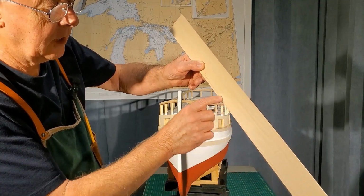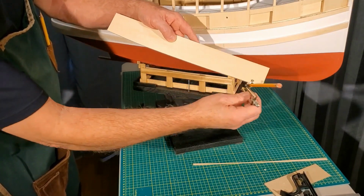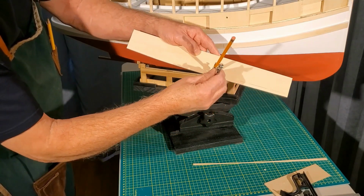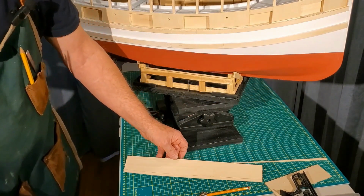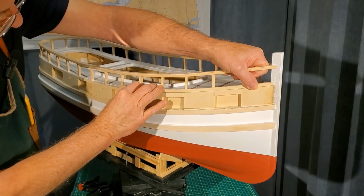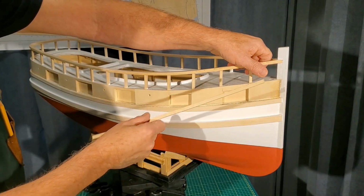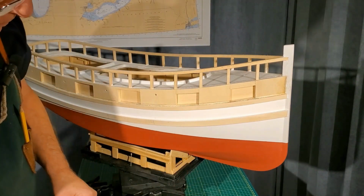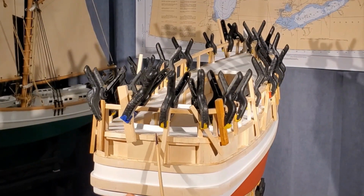And then I'll cut out this line. And now using my marker tool, which is set to just over 1/4 of an inch, I'll make a line along that curve. And now cut that out. And here's our piece. And that's a pretty good fit. So I'll go ahead now and cut all the pieces I need for this strip and clamp them in place all the way around the boat. And here's the 1/4 inch strip, all glued and clamped in place.